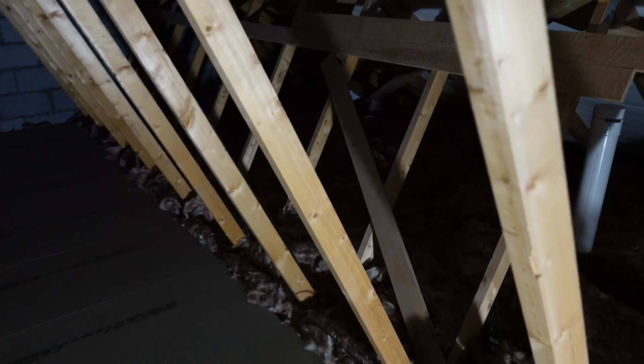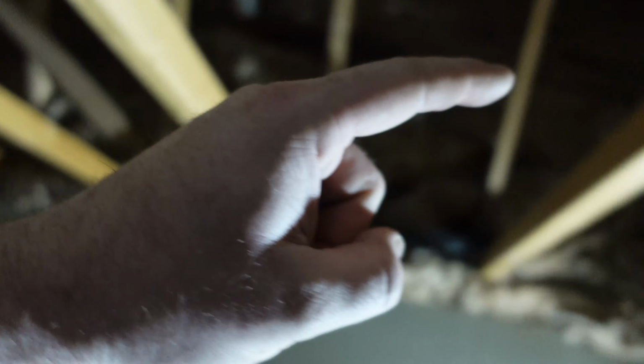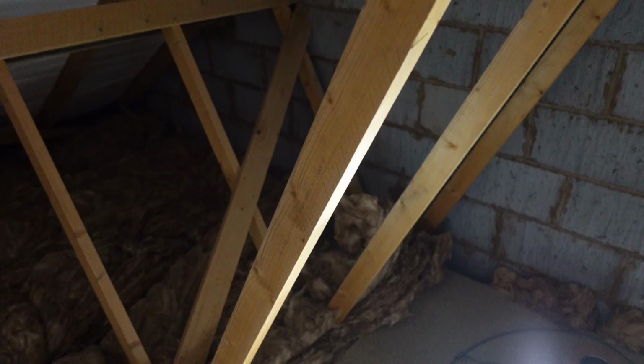So I've brought the drum up with me. And then the isolator for that fan will be round here somewhere, and the socket that we're going to come off. So that's there. Drum of 2.5 will go over and down there. The 1.5 will come up. What I'm probably going to do is bring it over to about here to put our receiver and then bounce off for our pendants. So this is where we got to in the loft.